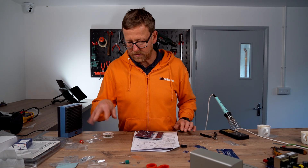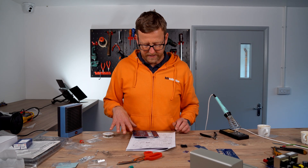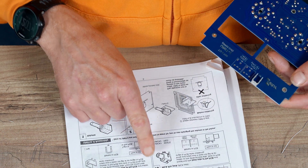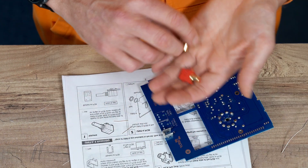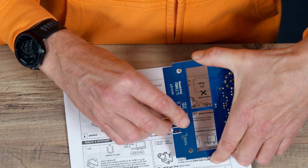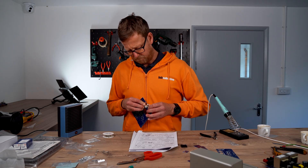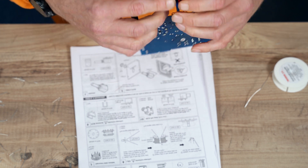PCB terminals — install from the back side of the PCB, so it goes in there. Also these — nice RCA inputs. White goes in there. Snaps in. Make sure they're flush before you solder them in.